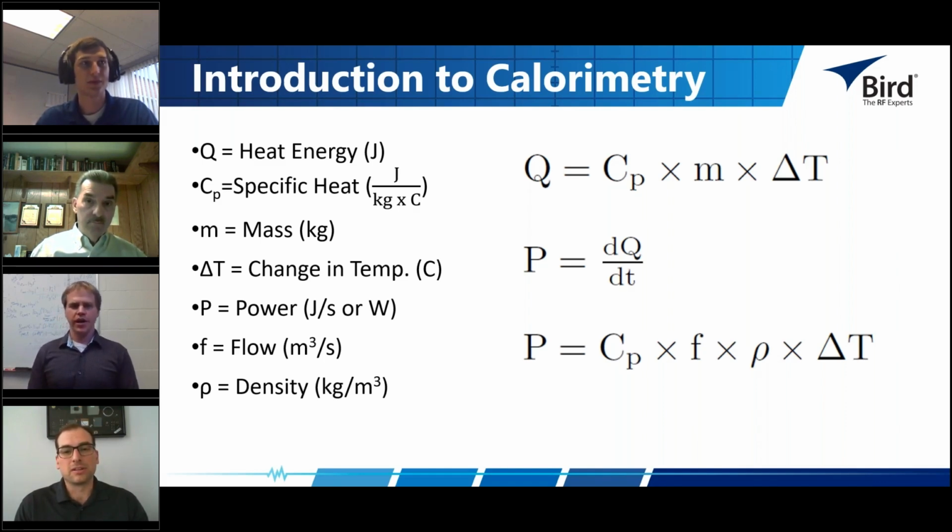Sure. For these 0.5% sensors, we've tested them across the dynamic range and across the frequency range, and they are 0.5% in those ranges at the cal points. If you go away from the cal points, they're not necessarily a 0.5% sensor, but at the calibration points and over the range of powers that they're quoted at, they are a 0.5% sensor.